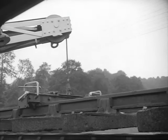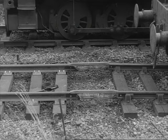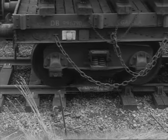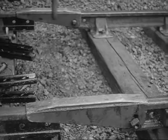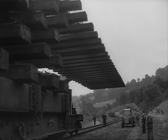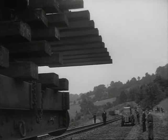So we can't lift out these two until we've hitched the wagon to the crane and pulled it over the temporary bridging piece onto new sections 6 and 5. Then we take out the bridging piece again and lift all sections 8 and 7 onto the wagon. When the scarifier has done his stuff, the ground's all ready for the cycle to repeat itself with new track section number 7. And we carry on as before, with each group of 6 sections, from one wagon load to the next.